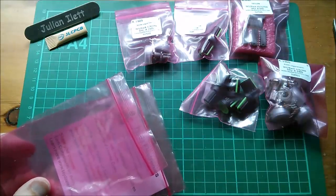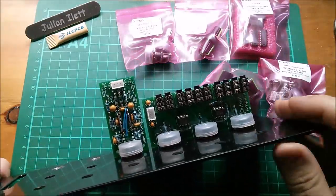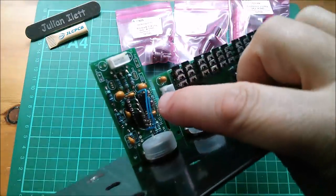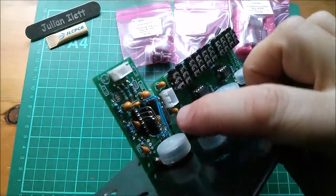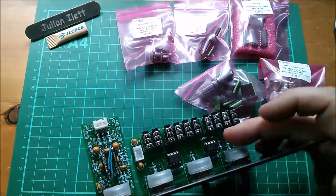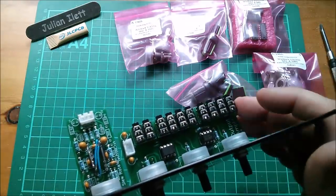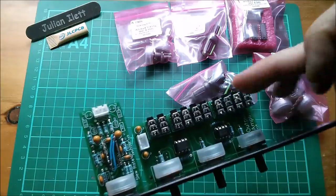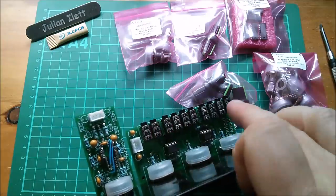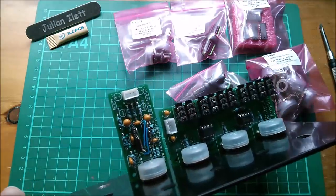Let's have a look at where the 556 is going first. There's not a lot on this panel at the moment because I've taken most of the boards off to rework them. This is the board that has my dual 555 bodged 556 — so that's going to come out. I'll put the 556 in. This is the output board that's going to a rev 2, so of course I need more of the 10k log pots. I'll do a reveal on it fairly soon. It gets rid of all these mini jacks and goes to a ribbon cable connector so that all the signals come down a ribbon cable. More about that later. Let's get this board off and put a 556 in it.